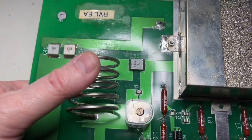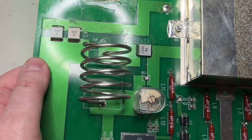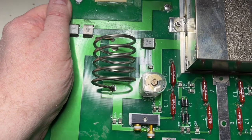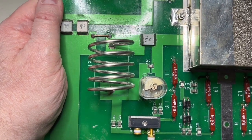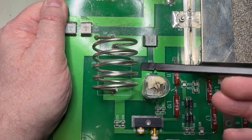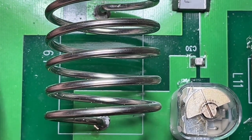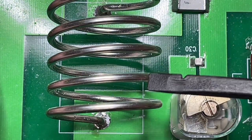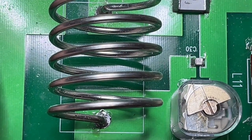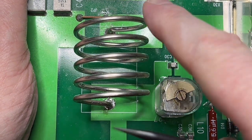The next interesting thing is the coils. This is a copper coil that is heavily plated, and you see it's six turns. In my opinion, this is from an older unit using a frequency in the ballpark of 60 to 64 MHz — because when I was building RF equipment, pirate FM transmitters for the frequency 88 to 108 MHz in Greece, we always had the primary coil with three turns. Of course this depends on the diameter of the coil and the capacitor in parallel, etc. But this one has five to six turns, so in my opinion we are very near to the 60 MHz range.